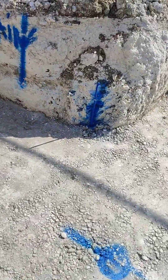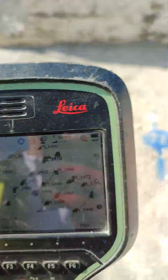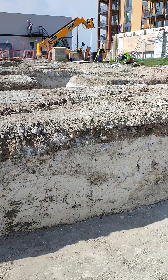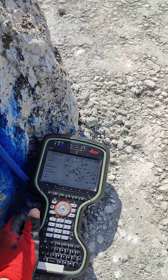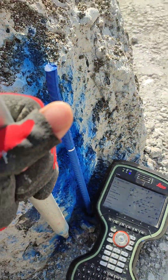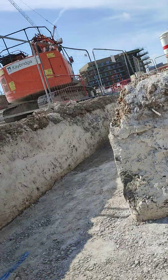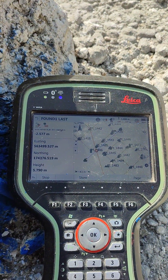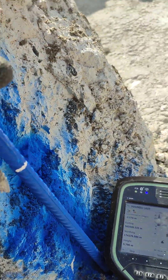If I click distance — target locked — so we start with this pin. We lock the target again, that's good. So we're in survey or measure mode where we want to survey the heights of the levels I've marked. I hold the pole straight to the point, and we have here 5.790 at this end mark — 5.790.